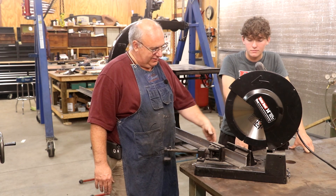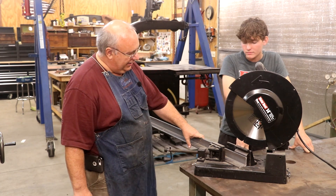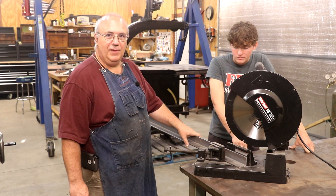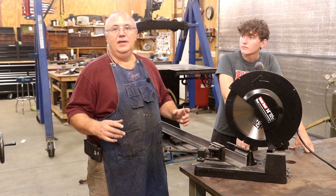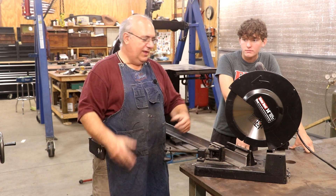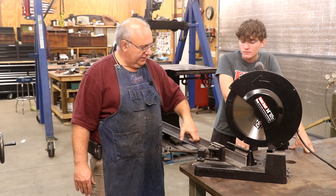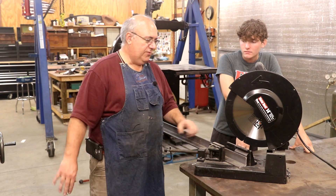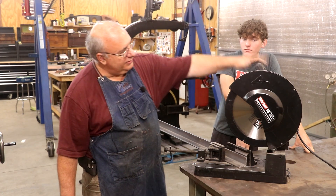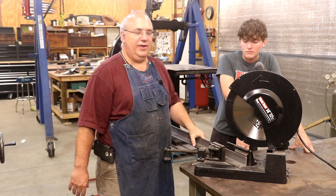What I've got is some angle iron — I think it's two inch, maybe inch and a half — quarter inch thick, pretty heavy stuff. I'm going to be cutting it into enough pieces to make a rectangle. The base of that saw is 44 inches long and about 20 inches wide, so we're making it just a little bit larger than that so the base sits right down in on the bottom shelf of the angle iron and the outside edge captures it. I'm cutting 45s on the ends using my Morse Metal Devil 14-inch metal cutting saw, which I've got set at 45 degrees.